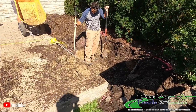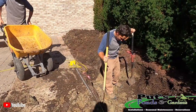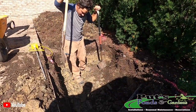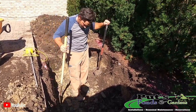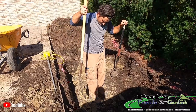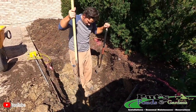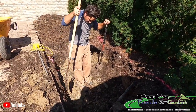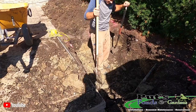The excavation of the basin is done. Derrick's moving the topsoil up into the stream area now. We've got the drainage pipe and irrigation line out. We found deck posts in the corner where Brian's at, so we're going to do some calculations to find out if we need to go any deeper and check our levels.